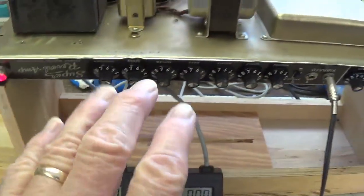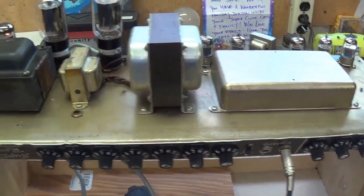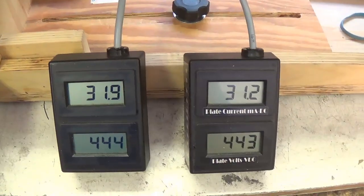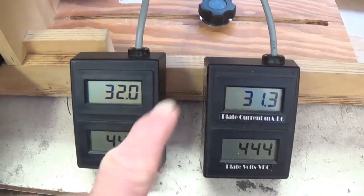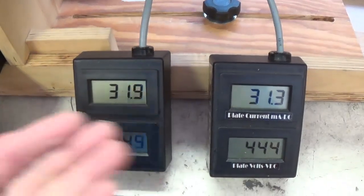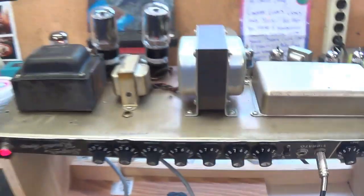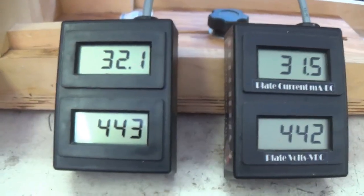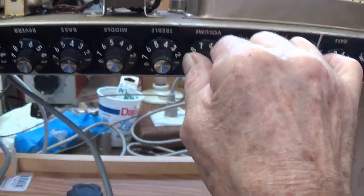Power is on, we're on standby, and since it's cold out here in the workshop and the tubes are too, let's give it a couple minutes to come up to a warm condition. I just took the amp off standby, and boy, you talk about a nicely matched pair of tubes. I'm really pleased with these Tube Amp Doctor 6L6s. That may be a little low, but look at the match. Just as nice as it could be. Okay, I'm not hearing any noises. I don't see any smoke. Let's now turn up our signal generator and see if we've got signal coming through both of our channels. The bias looks very conservative, so we'll do no harm if we proceed to check the channel.